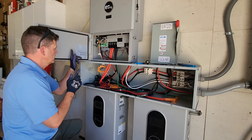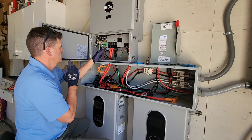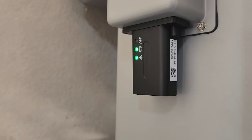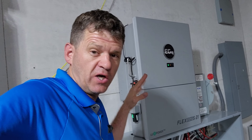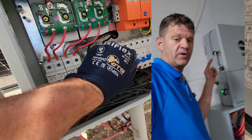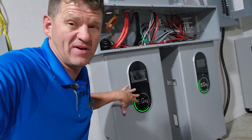Okay, I think we are good. I have a screen for this but I'll worry about that later. I set up the WiFi dongle earlier. Let's go ahead and turn it on — no battery breakers, so breakers to the on position. We're just going to have battery power only to this. Let me turn them on one at a time. Connecting to the cloud — sweet. I was able to log on to the web portal, changed everything back to default settings, and did the firmware update. After that I told this inverter I had EG4 lithium batteries, and I could see my charge percentage. I went out to my solar array, turned on the solar, and it charged my battery. The battery is right about 35 percent, so I think I'm just going to turn it on so it will run my house.